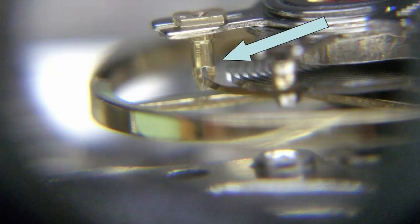The escapement must be in adjustment, and the clearances — or what we call divisions — must be correct so that no parts are touching each other. The hairspring must be centered on the collet and level under the balance bridge. The gap between the regulator pins or the regulator key should be parallel and as close as possible without squeezing the hairspring.